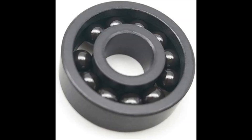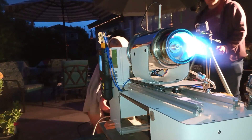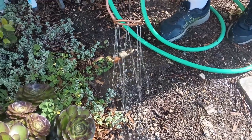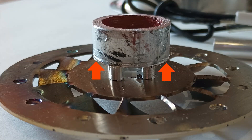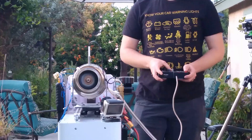What I really needed were cageless bearings made completely of silicon nitride. I've already ordered them, but they are not cheap and will take nearly a month to ship. I also noticed very uneven combustion from several clogged injectors, so I made a new injector and installed it. I also put standoffs on the bearing holder to minimize conducted heat, hoping the plastic in the bearings wouldn't melt again.